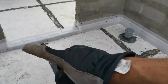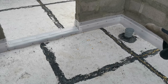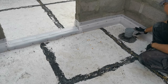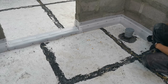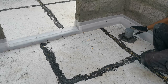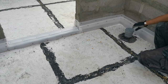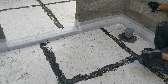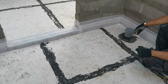And as you can see here, this is the final product. The concrete will be on this level, and as you can see, it's around 1 centimeter below the maximum height that this came in. So the concrete will be poured around here and given the right slope for the drainage, and this will prevent later on, if the concrete wants to expand, if I turn up the heating, the concrete will expand, and so it doesn't move the walls, it has room to expand.